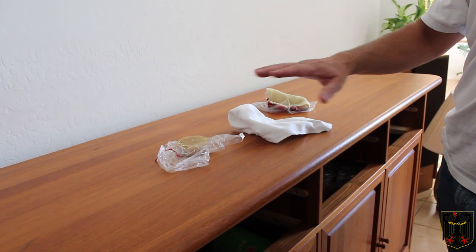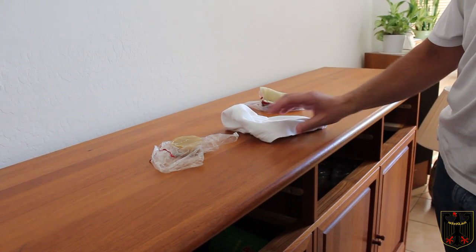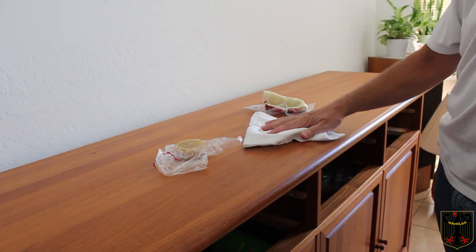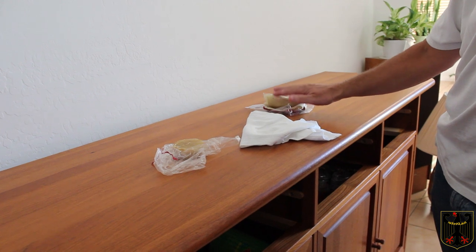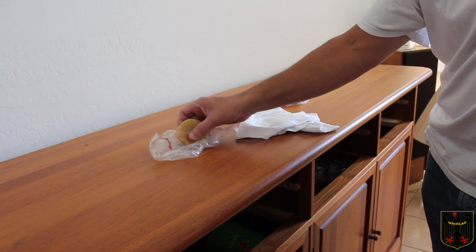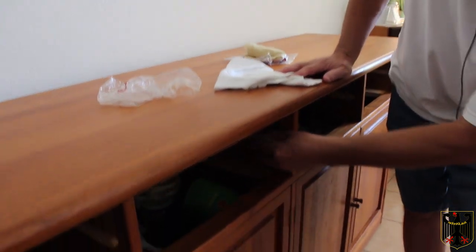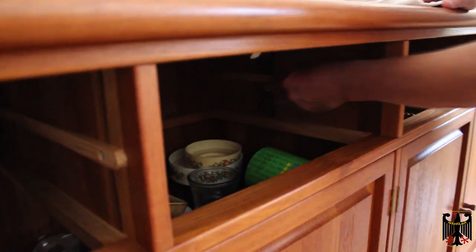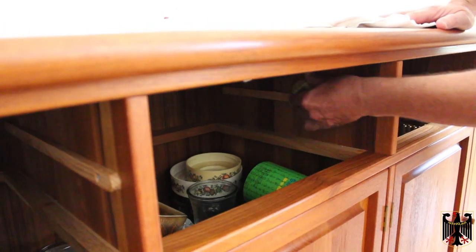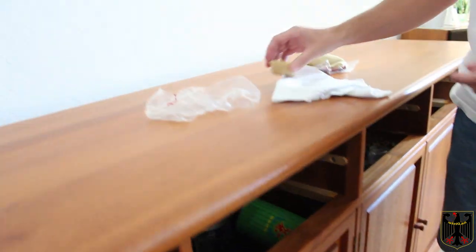At this point, I've finished using the steel wool and turpentine to clean all the surfaces, and I've wiped everything down. Now I'm going to go over them one last time with a clean dry cloth, followed by a tack cloth. The tack cloth is to get rid of any iron filings from the steel wool. Then before I put the drawers back in, I'm going to take this beeswax and go over the drawer sliders real well so the drawers slide in and out real easily.